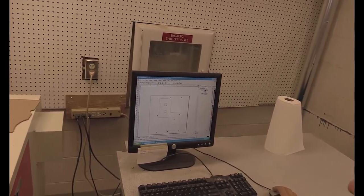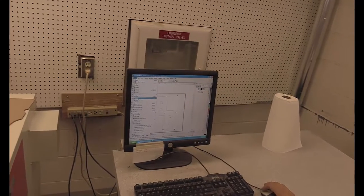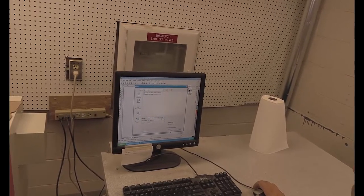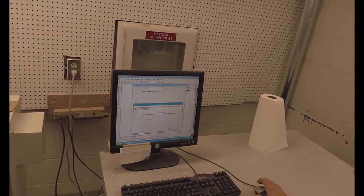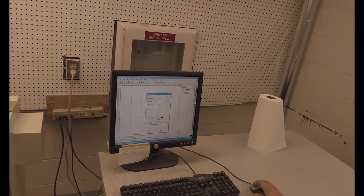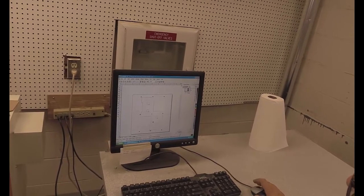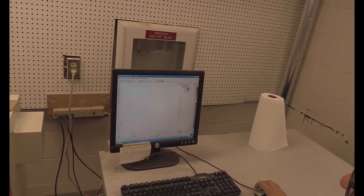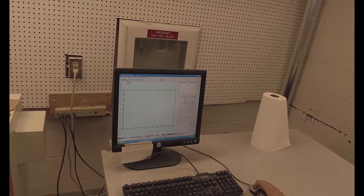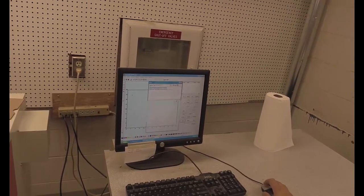Well, since it's just basic line artwork, I'm going to go ahead and export that file out. I'm going to call this one version 2 right here. I'm going to export it out, and it asks if I want to place that. I'm going to say yes. AutoCAD 2004 is fine. We'll hit OK. And now I'm going to go to LaserCut 5.3 and import that file that I just created, which is the backer, as you see right here, and place it.